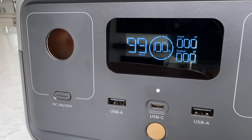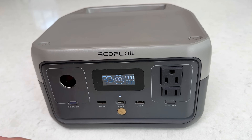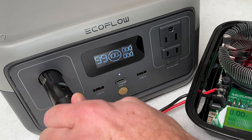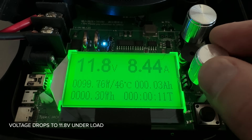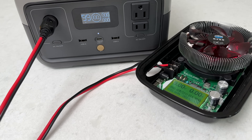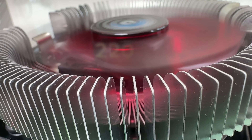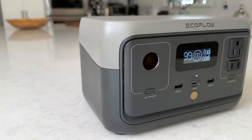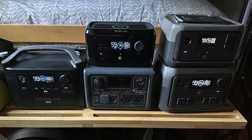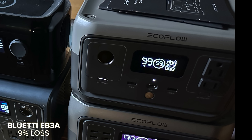On the left is a 100-watt cigarette-style port with a regulated DC output at 12.6 volts. There isn't a protective cover over the port, so you need to be mindful of dirt and water. In my tests, I confirmed the voltage was a steady 12.6 volts regardless of the battery's state of charge, and I could pull a full 100 watts or 8 amps. I connected a steady 50-watt load for 5 hours in a 0.2C test and measured 220 watt-hours, which is 86% of the rated capacity — a very good result for such a small unit. Standby losses over 24 hours with DC ports on were only 1%, which is incredibly good.